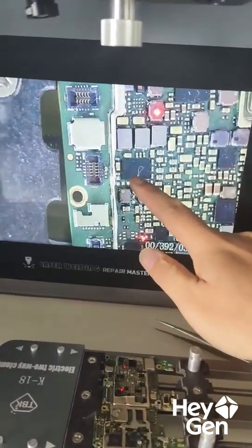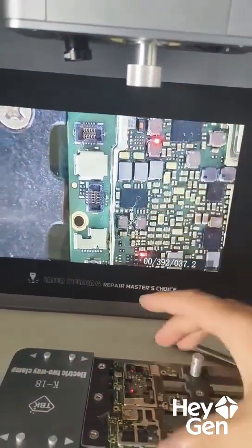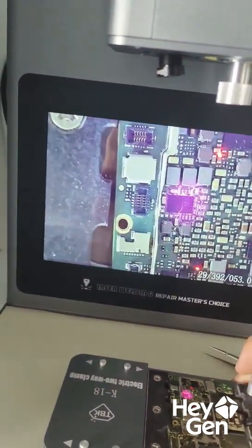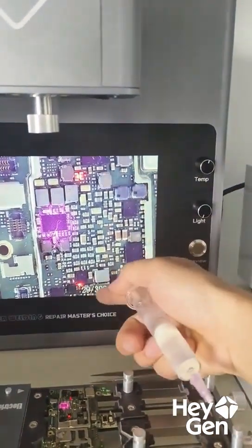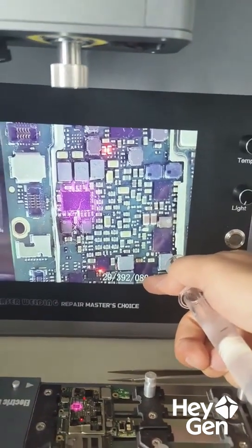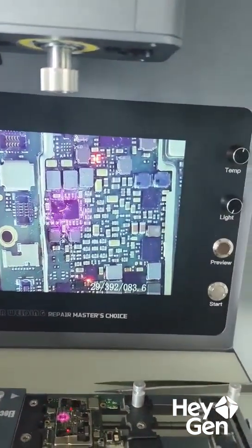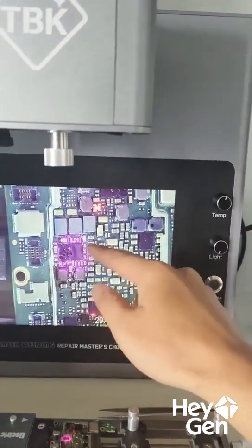For example, let's remove the chip now. First, we need to click preview. The spot size is about right — it's about this big. While previewing, it's also heating up. At first it was just over 50 degrees, but now it's already over 70. Apply a little flux as needed, add a bit of soldering oil. While preheating, you can also increase the power a little.